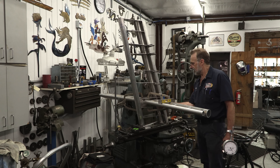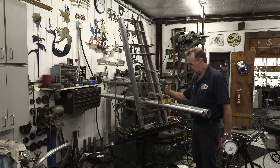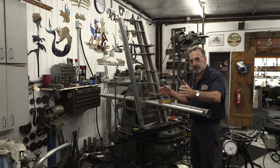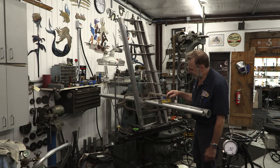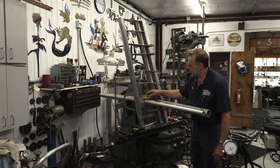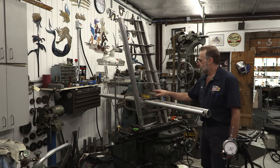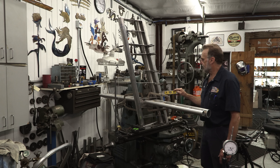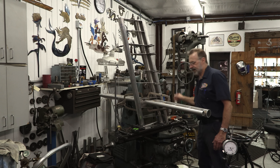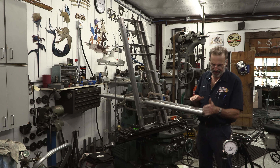Number three holds the lower spreader in position. This top piece is the next one we're going to be tacking. We drew a center line on that rib between front and back, and it's square to that axis. It looks good on the level both ways, and this rib is within the tolerances we're shooting for in both directions. So we're going to go ahead and tack that one and move on up to the upper arm.